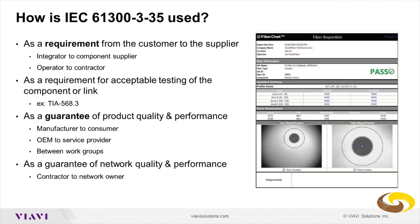On the bottom left, you see a picture of a connector, and you may say, okay, is it a pass or is it a fail? You don't know for sure. While when you use the built-in capabilities of the microscope, it will take a picture, analyze it, and give you all the defects and give you a pass or a fail criteria. So this is pretty much how the microscope works. So you can join our next video on the P5000i with a laptop or PC connection to show you how our FiberCheck Pro software works with the P5000i.